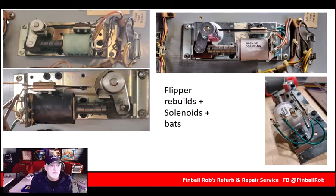Flippers were in pretty poor shape. You can see on the left side the bottom flipper was burnt, the top one was working but it was pretty weak. In most of my restorations, even though there's a lot of discussions around replacing the coils, I replaced the coils, I replaced the bats, and I rebuilt with new switches and new bushings to really give these flippers the rework they need. Again, 38 years old — these things are hit millions of times over the years. So it's just a really smart thing to rebuild your flippers, throw out the old coils, get rid of the switches, and your game's going to play a heck of a lot nicer.